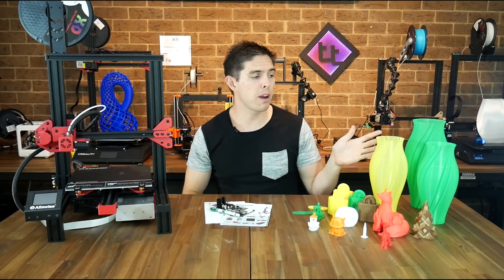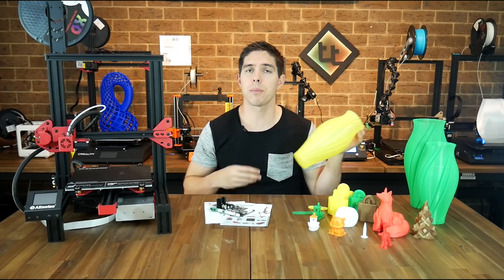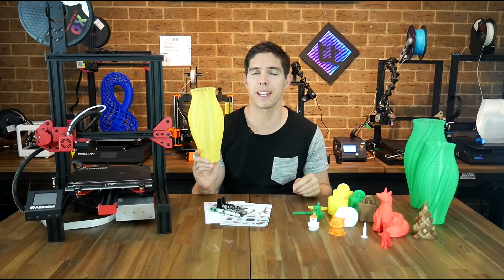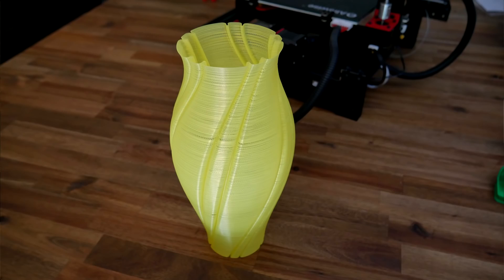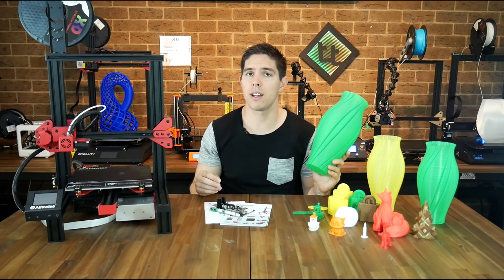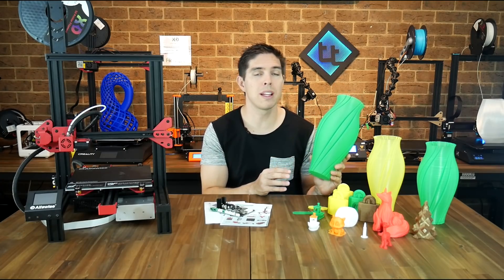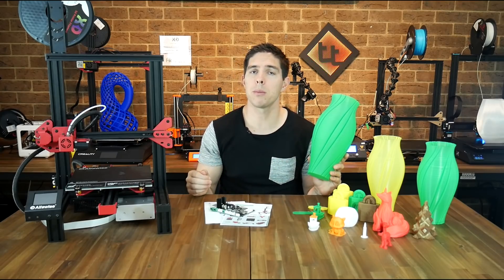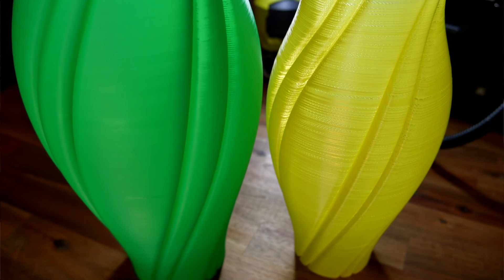My next print was this spiral bars model, and it did finish completely first time round, but it's suffering from really bad under-extrusion again. The surface quality is already pretty poor, but when you hold it up to a light, you can see the sections where it's completely see-through. Compare that to a test print done on the Ender 5 around the same time — the exact same model, in the same slicer, same filament, just scaled up to match the 300mm height of the Ender 5. The difference in quality between them is night and day.